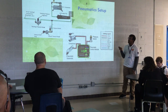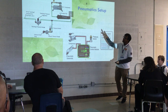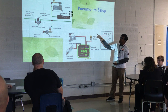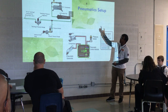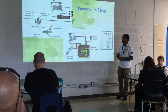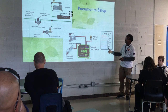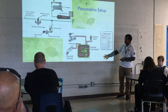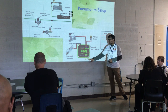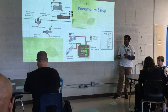Here are two diagrams I always like to have when doing PCM wiring. The top-left diagram shows everything other than the PCM and solenoids — it shows where the pressure switch, both gauges, your compressor, and storage tank should be positioned so you know the proper airflow path. The bottom diagram includes labeling and shows where each wire should go. If you notice, there are yellow CAN wires connecting from the PCM to your PDP to your RoboRio and through all your motor controllers.